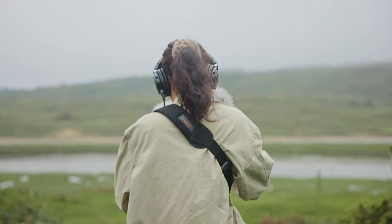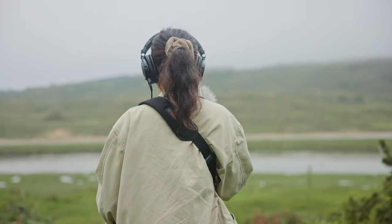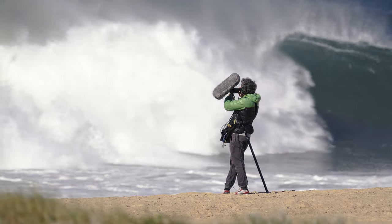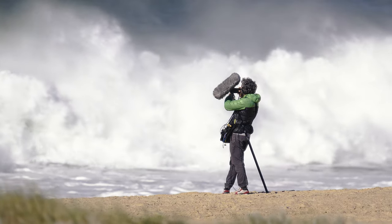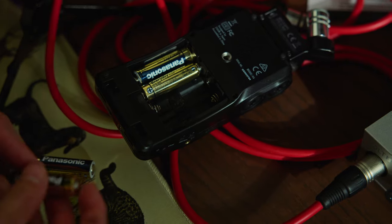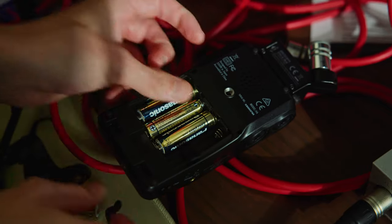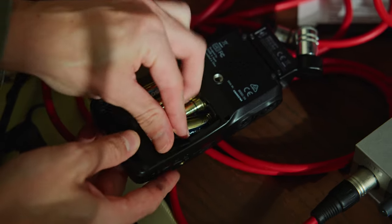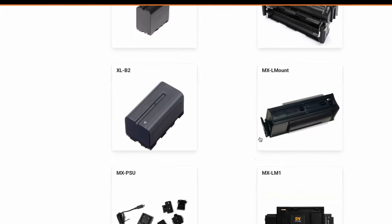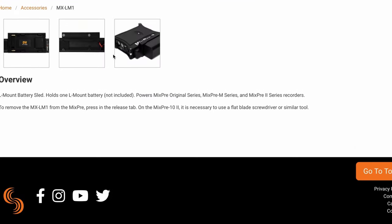Importantly, one of the standout features of devices like the MixPre-6 is their superior sound quality, thanks to top-tier preamps that deliver exceptional sound clarity and reduce noise. A preamp will produce a greater signal-to-noise ratio, meaning your audio will be cleaner in noisy situations. However, this does come with a price in terms of power. Handheld recorders will typically use household batteries like AA, and while it is possible to use AA batteries in a field mixer, you won't last for long, as they typically need to be powered by a larger battery unit or a power bank.